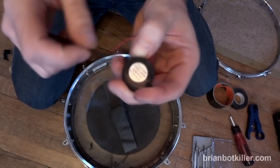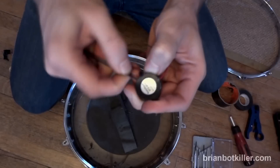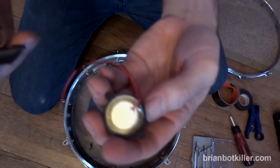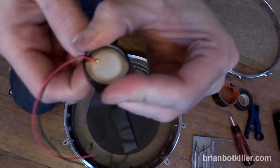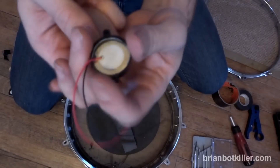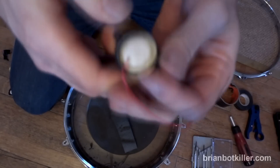I've already started working on this one — as you can see it's in this plastic packaging or little case here. You don't want that on there; you want the actual transducer. So take a screwdriver and just pry at this plastic until you're able to get it off. Once you start getting it, it's going to come off fairly easily. Now the only other tricky thing is getting the transducer itself out. Take your screwdriver, put it through the hole on the front, move it to the edge of the transducer as far as you can, and then just push lightly. You're going to bend it a little bit, unfortunately — that's going to happen. But with a good pop you should hear it pry out, and you can see it's already coming.